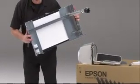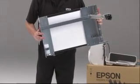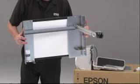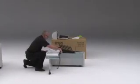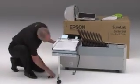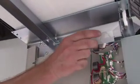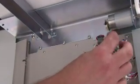When I pick up the conveyor, notice I still have some packing material in the lower right corner. That protects the motor and the encoder strip. It's very important that I leave that there until I'm done, because I don't want to damage that piece. I'll line it up and start attaching the screws. Once I'm done and assured that it's tight, I can remove the protective cover from the motor and then make the connection from the sorter to the conveyor.